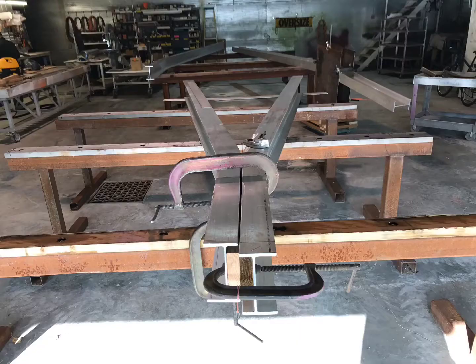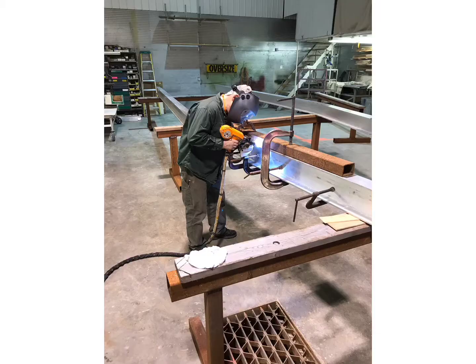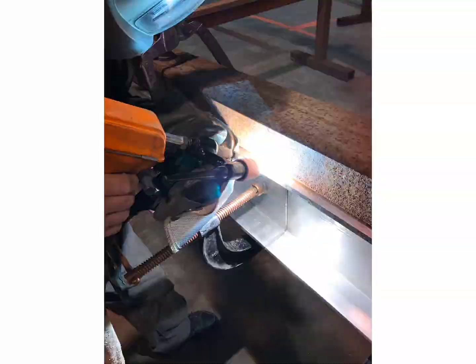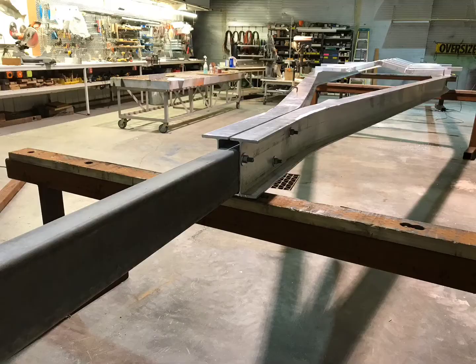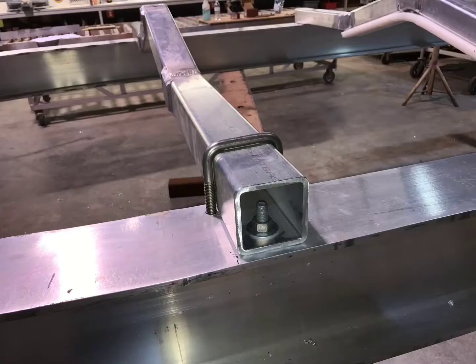So we're getting ready to join them together here. Had a splice on each side. The I-beams are approximately 37 and a half feet long. This is where we put some steel on the butt splices. We beveled full bevel out, and then my buddy Kevin brought out the big gun — the MIG-TIG combination welder — and he glued them all together. They aren't coming apart.